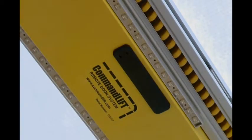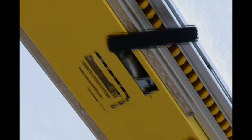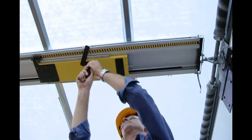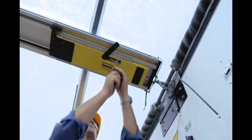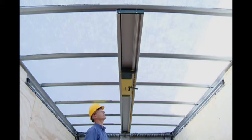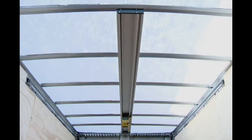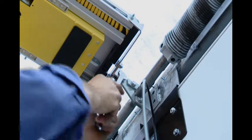Open the black access panel on the motor unit and you'll see a metal lever. Insert a screwdriver in the hole on this lever and pull it towards the roll-up door to release the motor unit, allowing it to slide freely along the track so you can continue to drill. Slide the motor unit by hand along the entire length of the track, watching and feeling for obstructions. Make sure fastener heads are not too large and the track joint is smooth and secure. Once the track is secure and straight, tighten all nuts and fasteners at the header bracket.